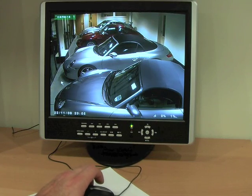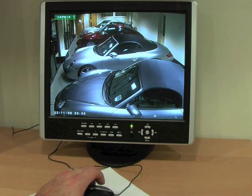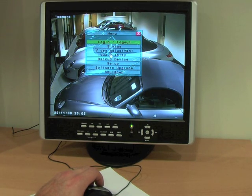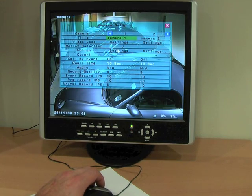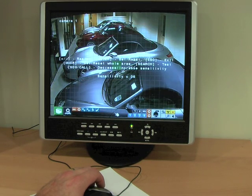Let's go back to the camera view. Right, what we want to do now is we want to motion trigger recording for people entering or leaving this doorway, but the rest of the screen we don't want to trigger motion sensed recording. So people walking up and down here won't trigger it. We can exclude certain areas of the screen from triggering motion sensed recording. Again, go to cameras, go to motion settings and go to detection settings.